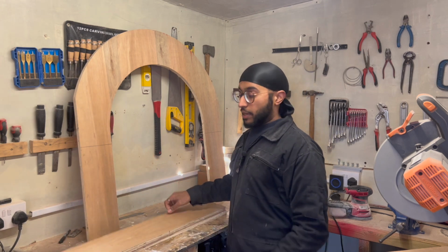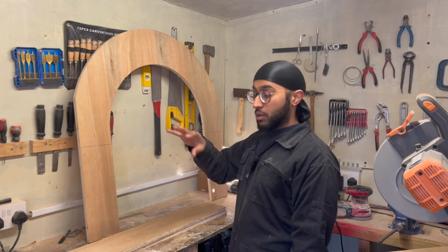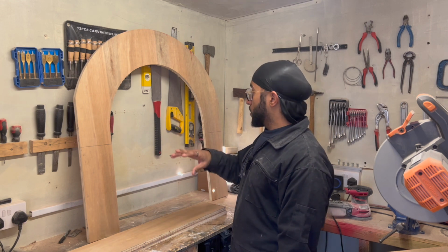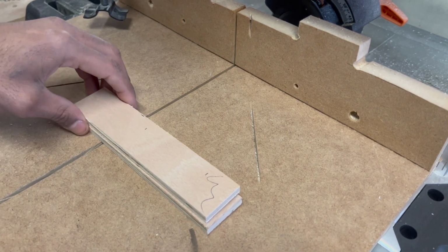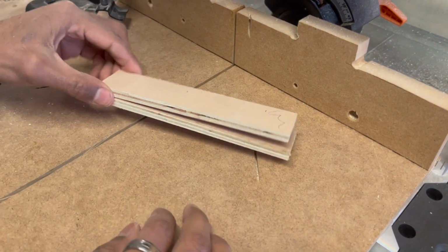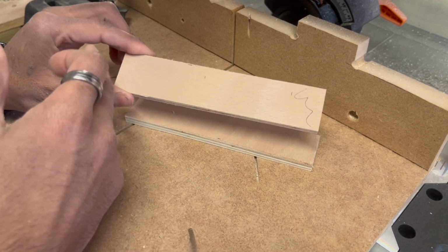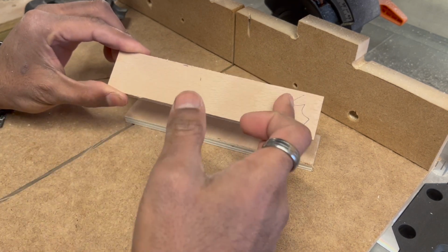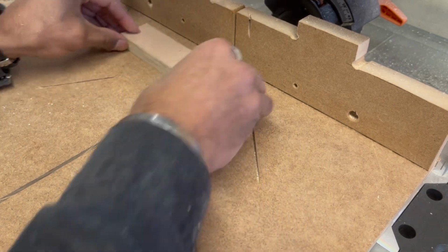So the next step now is just to make some legs. They're going to be really simple on this, and I'll show you what hinges I've got for those. Spacers for the standard hinges. Hinge spacers, very similar to all the others. I've got a piece here that's 35 millimeters wide, and then I'm going to chop it down to 75 millimeter lengths. So just need 4 of these this time around,